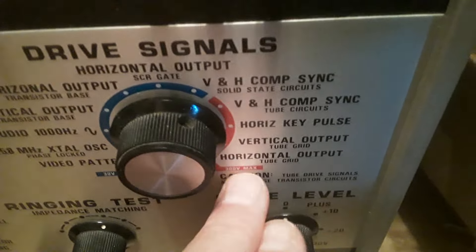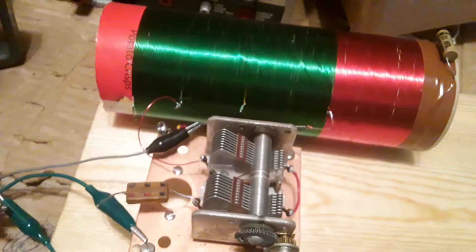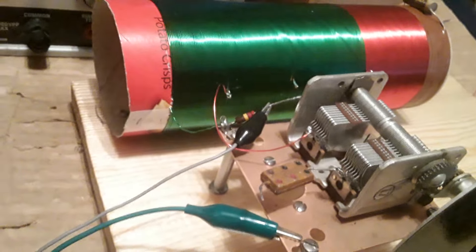I'm pretty happy with this. I don't know about that grid leak type stuff — if I'm going to try building one of those, I see stuff with a 3V4, which is a 1.5-volt filament tube, 12AU7 tubes running at very low voltage. But I also have a bag of automotive tubes for car radios which run at 12.6 volts for the filaments and very low plate and grid number two voltages. The pig on that would be the filaments since they're not wimpy filaments in those automotive tubes.